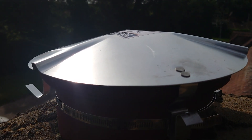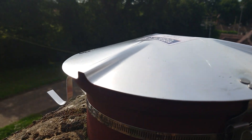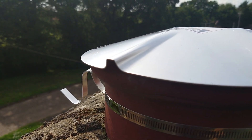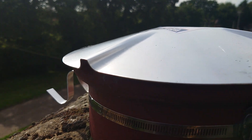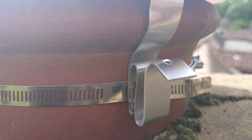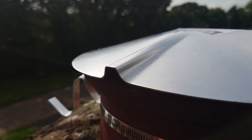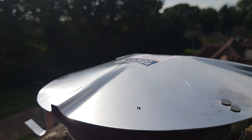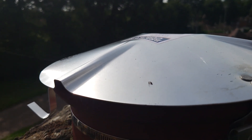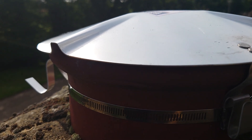At Zachary Sweeps we do all that sort of stuff, so if I do do it, I will do a video of it as well. I just wanted to show you how I put these on, because I don't do them the same as other people. These strap caps are great because they have little air vents on either side — there are three of them altogether. They allow the air to circulate in the chimney and they also stop any rain coming in. Even driving rain will find it very difficult to get into it, but it allows enough air to circulate in the chimney.